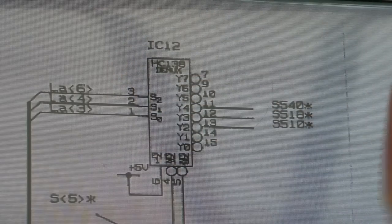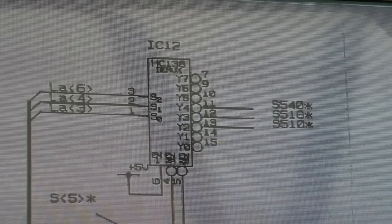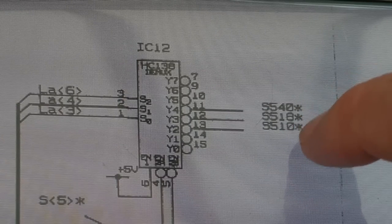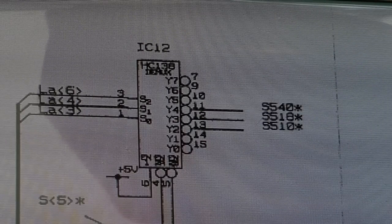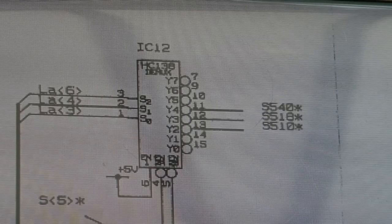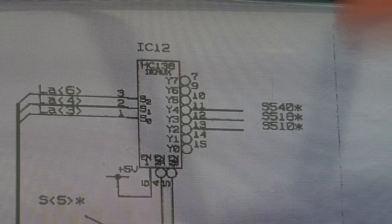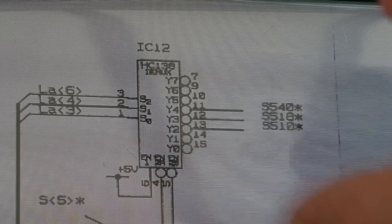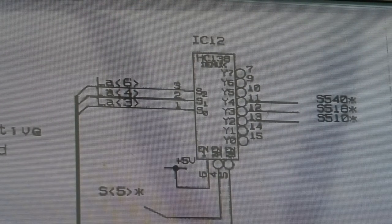And yeah, that is doing the address decoding there. You've got some address bits coming in, and that's going to control whether the floppy disk controller gets communication, probably from the BD bus, I would think, and that explains it entirely. If you've got a problem with address decoding here, and that buffer is enabled when it shouldn't be, communication from the BD bus is going to go through to the floppy drive interface when it shouldn't be doing. It's erroneously communicating with the floppy controller. So the floppy controller is doing weird things. It was moving the motor, wasn't it? The motor was going because it was picking up signals, it's picking up data that's not intended for it.